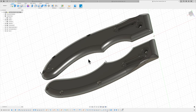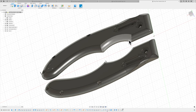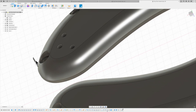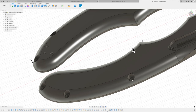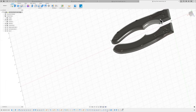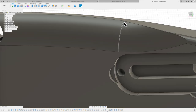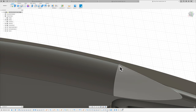Similar to what I did on the jet scooter project, I took a photograph of my handle slab, imported it into Fusion, and that helped quite a bit with getting around the geometry. I was pretty happy with the design overall, but I noticed a couple of little extra bits of material that weren't supposed to be there — one on the end, one on the mirror image, and one harder-to-see piece along what's called the loft.